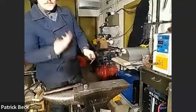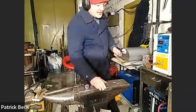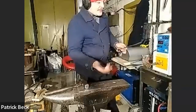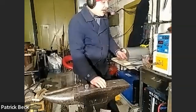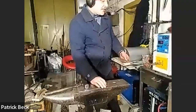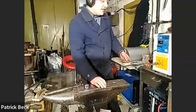Now it's thin enough to turn and form the cup. Some texture is totally fine - in any way it's supposed to look hand-forged after all. Now we have the same problem again, and there's yet another fix: you can insert the piece at an angle and heat only part of the section.